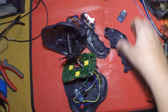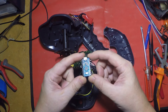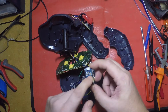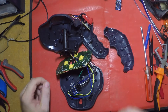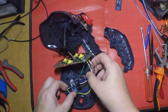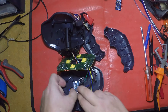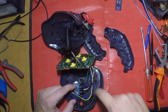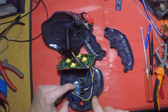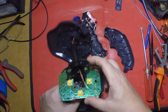The key thing was: what was I going to do? How was I going to fit one of these in here, which is a Pro Micro — an Arduino basically, based on a chip — and running Daemon Bytes software, it turns this into a joystick controller. I worked out that this board sits on here and is supported quite well, which gives us space to actually put this underneath. And I think it'll be going here in the long haul. That's where it will be going, with the USB cable coming out there. I'll tie it around here, run it through here, tie it off against this more solid post, and then out here. This board will then go down on top of it and the whole thing can be reassembled.